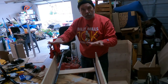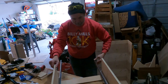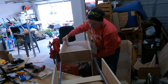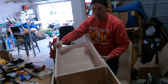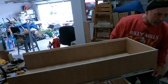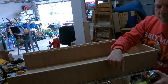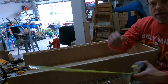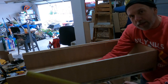I got the slides in the base and on the drawer. Let's see if we can get them matched up and see how well it works. Well, this might be a problem. I thought I had accounted for enough width — 15 inches — but I forgot to factor in the length of those slides, so it's actually 16. I need an inch and a half, and the difference between the outside of this and the inside of this is only an inch.